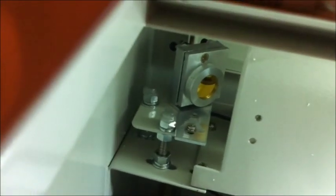There are two different mirrors you may need to adjust to get things working properly. There's this one here known as the Y-axis mirror, and there's also one in back known as the X-axis mirror. Both mirrors are adjusted using an allen wrench with little screws — there are three here and four on the one in back. This is a tedious process; you've got to go slow and keep trying, and eventually you get it. The one in back is particularly difficult because you need to get at it through the back of the laser.